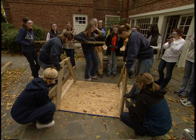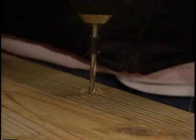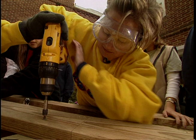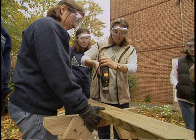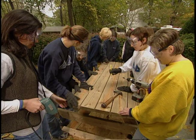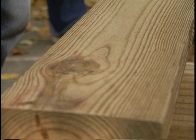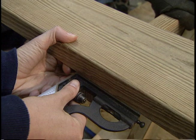Setting the first plank for the tabletop in place had the Deltas singing. But it was time for more clearance holes and more screws — music class will have to wait for a while. The Tri-Delts are doing a great job and have gotten power tools down to a science. Put this hand up on the top and kind of lean on this a little bit. Quarter-inch spacers ensure that the planks will be nice and even. Now we've got an assembly line going, which speeds things up. The tabletop is put together in no time. The benches are next — we'll make sure the outside board overhangs the supports evenly on both ends and sides. The combination square keeps the offset consistent.